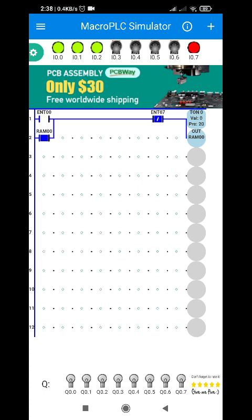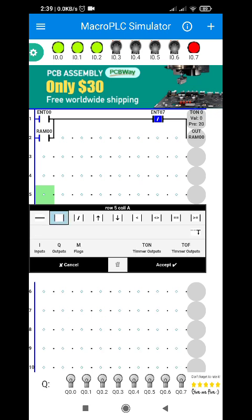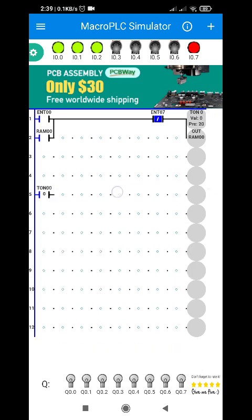The latching is successful. I'm going to reset this one. After 2 seconds, we're going to energize a light bulb. I suggest do not add the new rung immediately after the first rung is created. To be safe, allocate a space, so later when you want to add a parallel connection, a parallel push button, or a parallel output, you will still have free space. So instead of using rung 3 or 4, I'm going to use rung 5. Using TON 0.0, we are going to energize a light bulb.